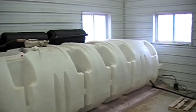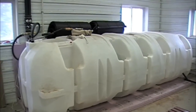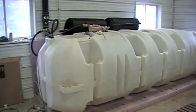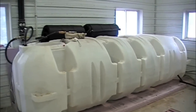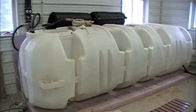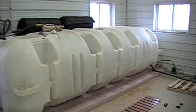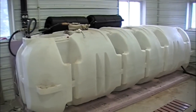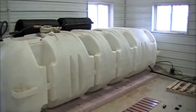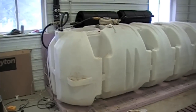The purpose of all of this is to allow a water source heat pump — which is often called a ground source heat pump or a geothermal heat pump — to be used as a multi-source heat pump. By incorporating a thermal battery with a water source heat pump, we now have the ability to use any number of different sources of energy, including solar, waste heat, traditional ground loops, air source components, biomass boilers, or whatever we happen to have. This particular component is the piece that makes that opportunity available — taking a ground source heat pump as traditionally known and turning it into a multi-source heat pump.